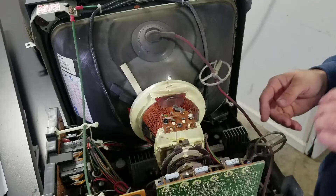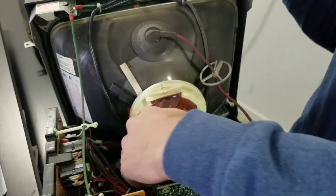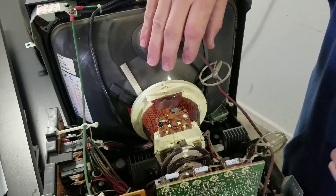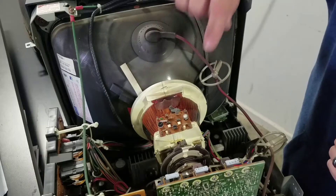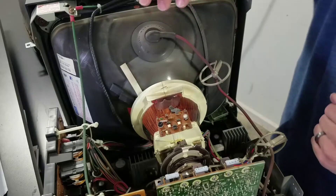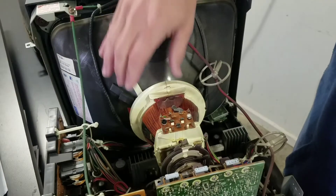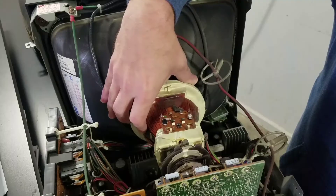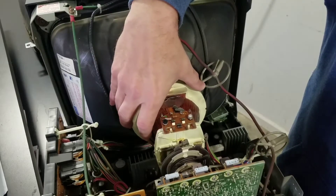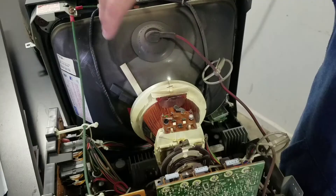To give you an idea of the adjustments or problems that might happen with your yoke — this one's loosened and you can see right away that it goes left and right rather easily. Please note that this is not energized and I've taken all proper safety precautions. Please make sure you familiarize yourself with all safety precautions for a CRT before doing any adjustment like this — I have plenty of safety videos on my channel. You can see how it freely turns left and right along the glass tube. When it's not pushed up against the tube, it either leans left, right, up, or down, or is pushed back a little, causing extreme color distortion along the edges of the picture.